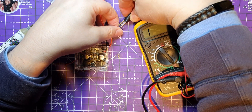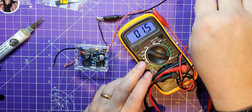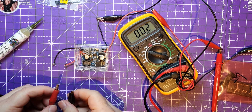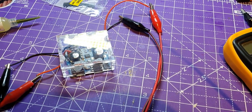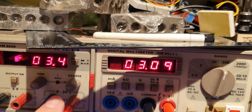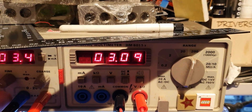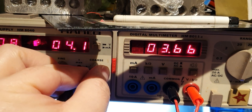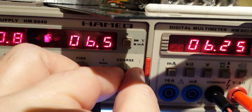So black there and red to the other one - you should be able to see the voltage now. As this is going up to 100-odd volts I'll set it to the 200 volt range; this one does DC and AC at the same time. I need to connect the black and red on the input side. Let's change the camera angle so we can see the voltages on the voltmeter. I've connected the input and output and connected it to my power supply. At the moment I'm putting in three volts and there's about three volts coming out - it was doing that before I broke it. Let's up the voltage going in because it should be 12 volts.